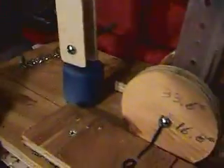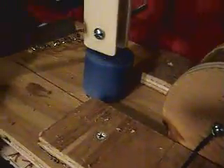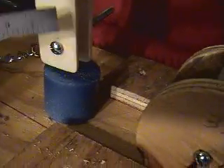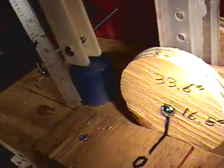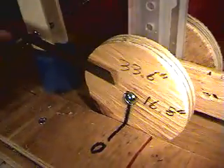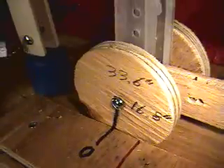Starting right here in the back — the hitch chain and hook represents a 46-inch chain. It hooks here securely to represent the pan. The hitch point, this bolt in the center, is 26 inches off the surface and 48 inches from the center of the rear axle.